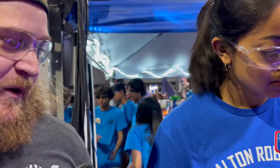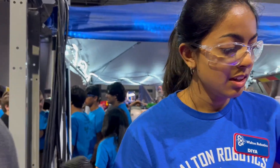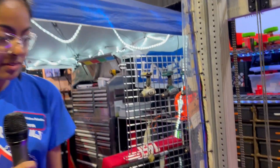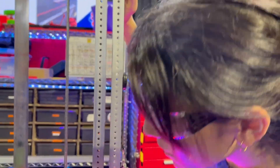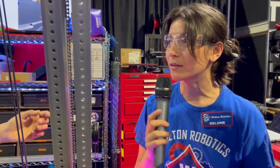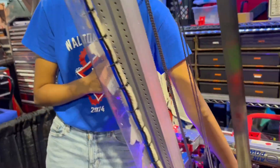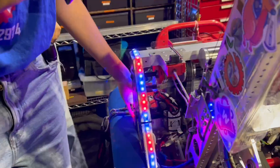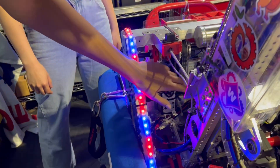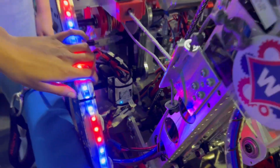We figured the Neo motor was a little more robust, especially with the pivot — it allows for a little more stalling without burning up. You can also directly attach an encoder to the Neo, so there's an encoder on top of the carriage. The Falcons add more horsepower to our elevator, which is why it moves really smoothly. We use Falcons on our elevator and drivetrain as they're a much more efficient motor. We chose a Neo 550 for the winch because we have limited space — it's the smallest motor we could find with enough speed and torque. We also accommodated for that by increasing the gear ratio on the pulleys.